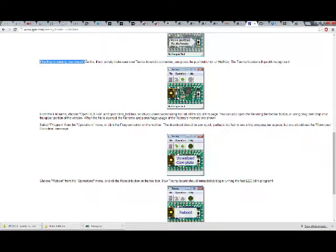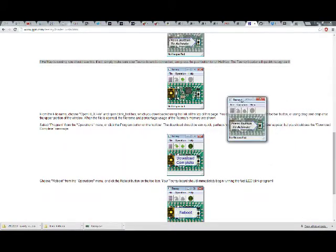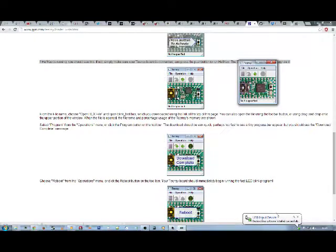So if HalfKay is running, you should see this. If not, simply make sure your Teensy board is connected and press the push button to run HalfKay. The Teensy loader will quickly recognize it. So let's see. I'm gonna press the button to activate using my itty bitty tweezers. I'm just gonna push it. Press the button. I got the installing device driver software. It recognizes it. Okay, so that's good. USB input device driver software installed successfully. It is no longer blinking here. No longer blinking.